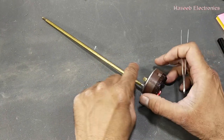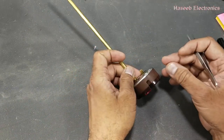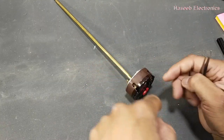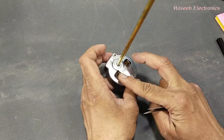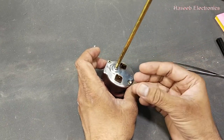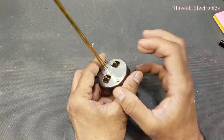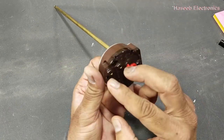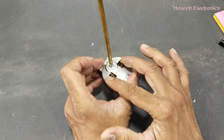When the room temperature — that is the cabin of the water geyser — is less than the required temperature, it will allow electrical current to pass to the heating element at these two points. So the heating element will start to heat up and the water in this cabin will heat up. It controls the temperature of the heating element. It has two output connection points for the indicator.